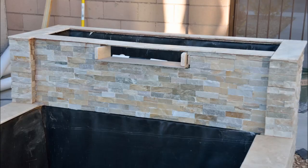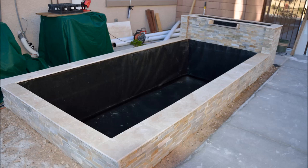The waterfall was the toughest to build. I had never made a waterfall spillway from scratch before. It looked simple enough but I looked for pre-made spillways to speed up the build process. I could not find anything that was big enough or it was more decorative than functional. I did many test runs with different materials and depths for the ledge, just filling the waterfall area using a water hose to visualize the runoff. I finalized the design using a ceramic floor tile that was 24 inches wide and 6 inches deep as the base for the spillway.